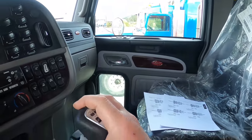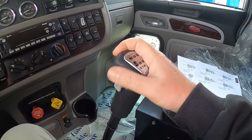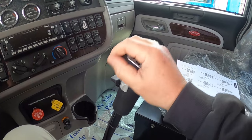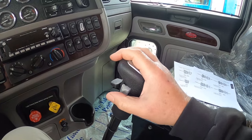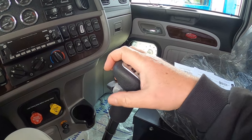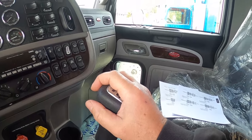If this helps save somebody some money, if it helps save a blown-up transmission, my job is done. Remember: when you're shifting your good old 18-speed, keep her forward in a tough pull. You can shift it normally all the way you do, but if you're going to be in a tough grunt, forward for the forward box, back is the back box. So always in a tough pull, keep it in the A box — forward, forward box.